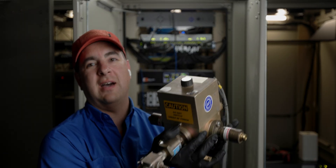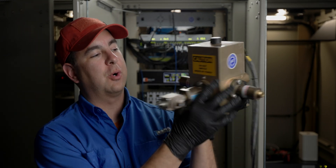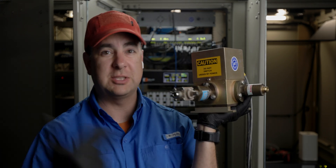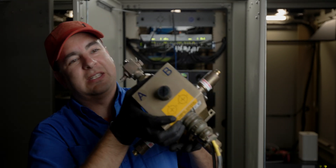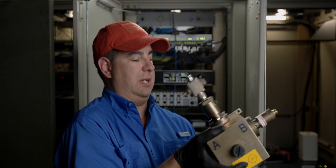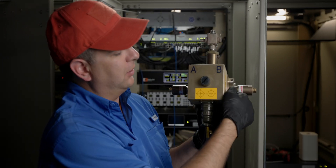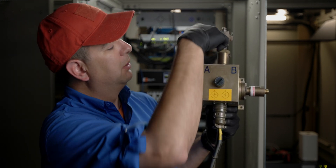Let's talk about one cool device — this is the coaxial switch. It has four ports on it. Two of these ports are for the two transmitters — you have two inputs and two outputs. It'll connect either port one to port two, or port one to port four. So while port one is connected to port two, port three is connected to port four.